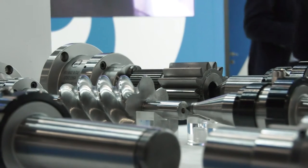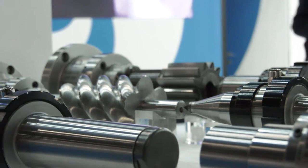Alberto, you are the expert — tell me all about these fantastic products. After what you see before about the soft turning, after that process normally the pieces need to finish the surface and maintain a very accurate tolerance on all the diameter of the pieces. So Technologia FRB developed a system where we can grind the pieces directly in one placement on all the parts that the pieces need to work.